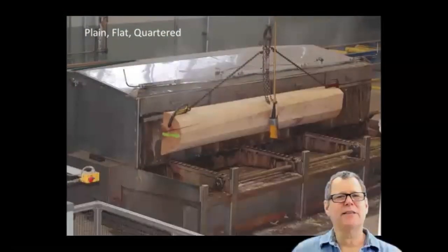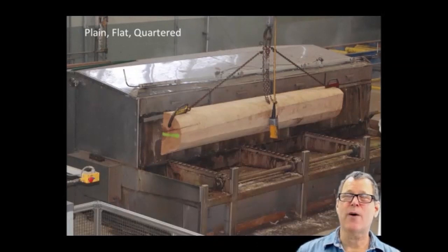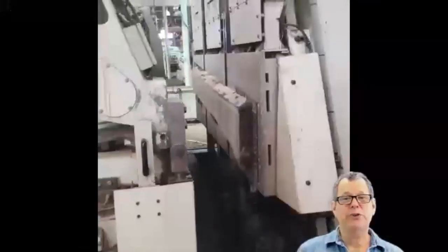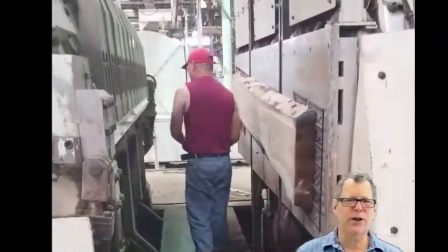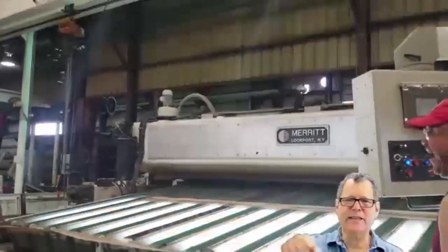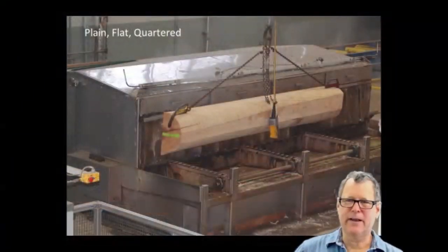Another type is the rotary rift cut on a 16-foot lathe. There are two bars that fit into a groove cut during the planning process; they put the log on there held by little T's — that's all that's holding half a log, which is pretty scary when it's whipping around. Then there's the plane slicer flat cut where the log is held onto a platen by a 225-horsepower, 250 CFM vacuum clamp — literally just held by vacuum. The blade slices upward and every stroke it clicks in one forty-second of an inch, and these sheets just come off in sequence. They inspect leaves periodically and when they find a scratch, they'll hand-sharpen the blade with a stone to keep it sharp — these things are razor sharp.